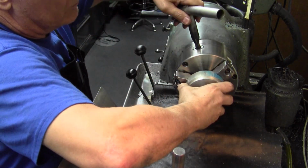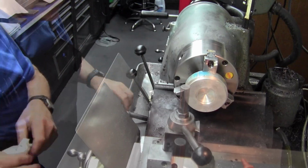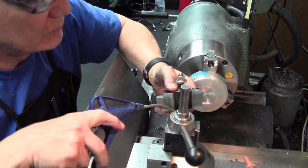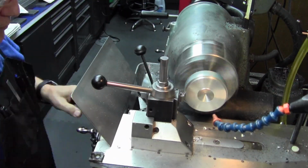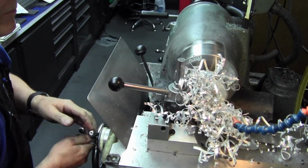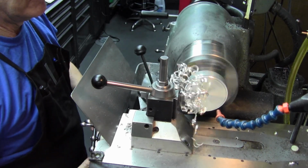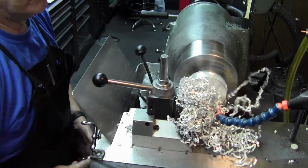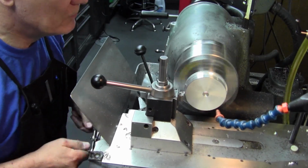Now we're going to start making the two laps, two different diameter laps. This is a chuck that I have dedicated to soft jaws, and right now we're just going to face off these two chunks that I happen to have on the stock rack. The reason you see me pulling the chips away here is I didn't want to clean out my chip pan of steel because I'm just doing a little bit of aluminum turning, so I'm just grabbing the chips and throwing them in my aluminum bucket instead of letting them fall in the pan.